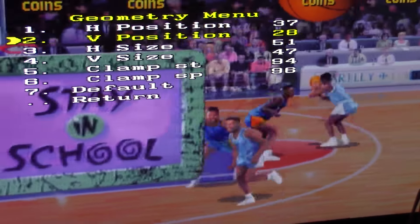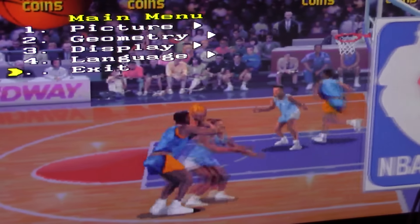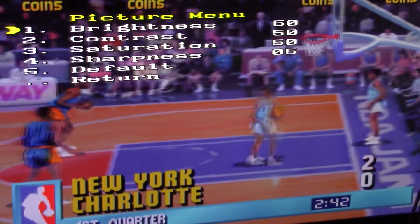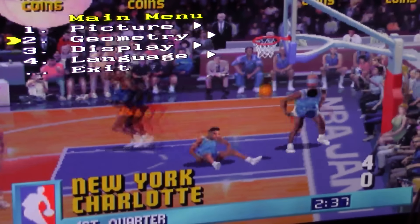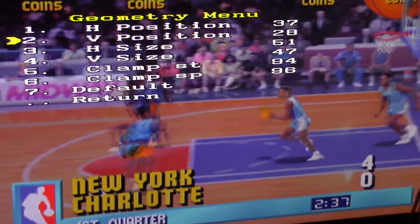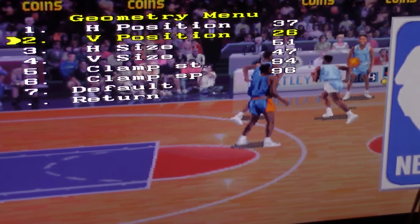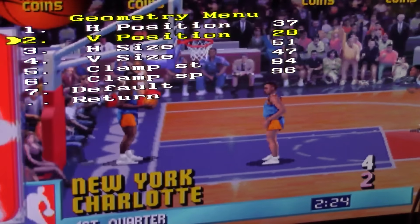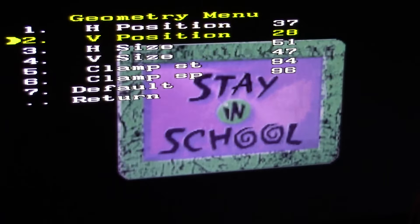You can see there — if I go back down to 27, it freezes. We'll go back to 28, and it unfreezes. So this entire time, the frozen screen problem has been nothing more than a vertical position adjustment.